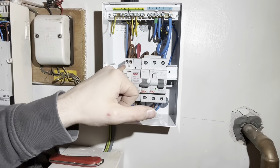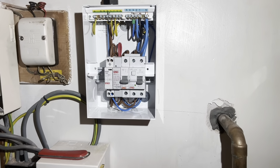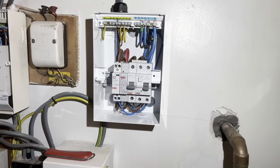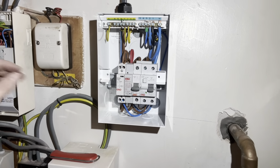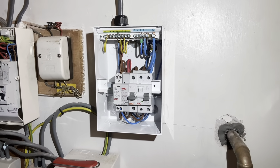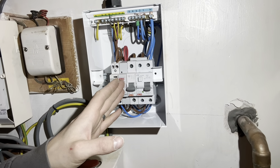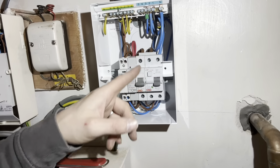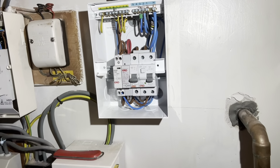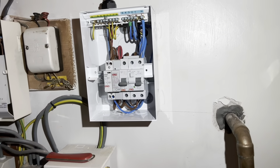The new shower, shower number two, comes out of terminal number one. I'll go and make safe the other end. They wanted white accessories but have changed their mind to chrome, so I'll just put in some wagos for now. I'll do a quick test on shower number two and also shower number one since I've worked on it. Shower two isn't installed yet so shower one upstairs will continue to run normally.